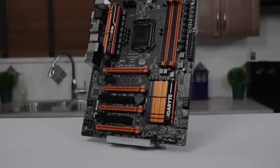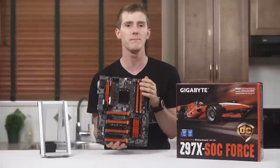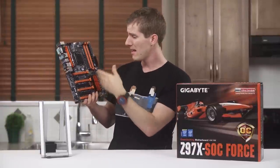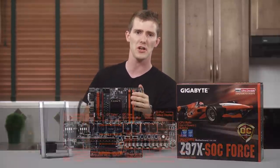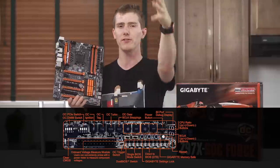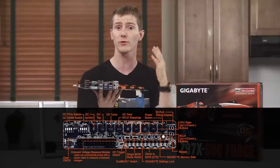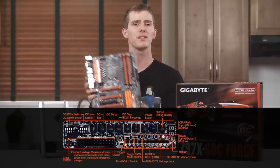Shifting back to the inside, the onboard fan headers are located in eight positions across the board, meaning that even some of the most ludicrous systems won't need to use anything outside of the onboard headers to power all the fans. Which leads us into one of the more exotic features of this board: OC Ignition. OC Ignition powers the motherboard and connected components like fans while the system is shut down. This is great for maintaining airflow to combat condensation and reduce cold bug issues for extreme overclocking. It's also great for building demo systems that just need to look like they're running but don't actually need to work.